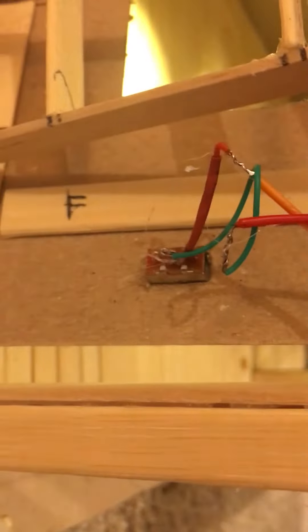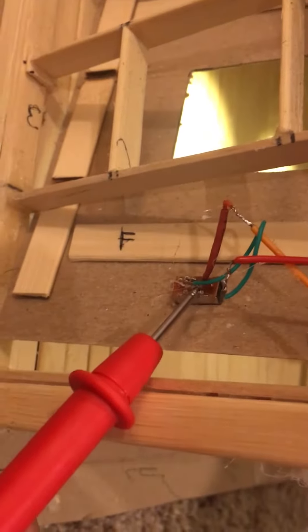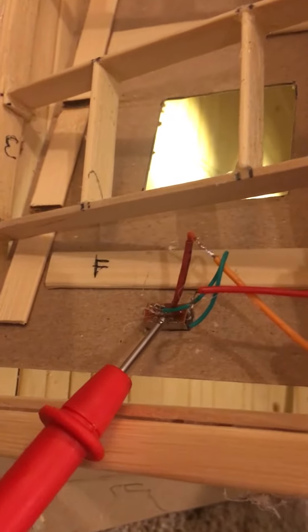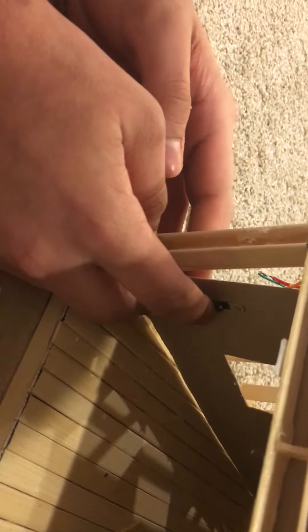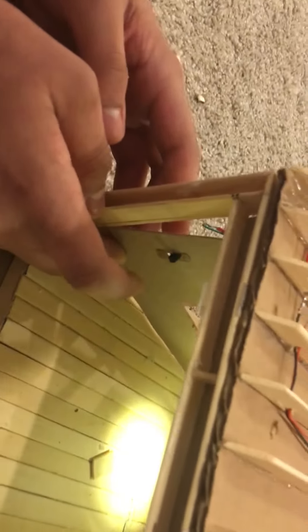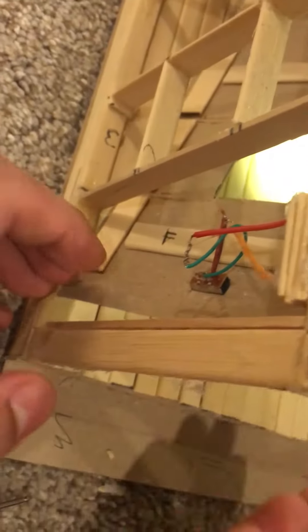This red one goes to this green wire, which goes to this switch terminal — this is a switch if you look on this side. The red goes to green, and the orange goes to — I think that's red. This is a shrink tube. So these two have the positive off the battery and the anode off the LED. When the switch is down, it connects the green wire with the bottom terminal, which is nothing. When the switch is up, it connects the green wire — the plus terminal of the battery — to the anode of the LED, and so the LEDs just turn on.